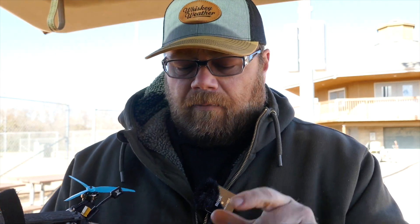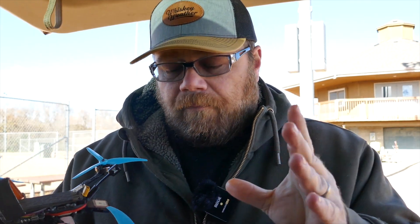Welcome back to Crowing FPV. This is actually my third attempt at doing this video. In the middle of making another video for this five-inch long-range quad, I ended up changing out the motors. I'm running the Emax ECO2 2004 stator size at 3000KV. Before I was running the same motor at 2000KV, and running it with 6S or lithium ion just didn't have quite the power. So I put the 3000KVs on and I'm running strictly lithium ions at 4S now.